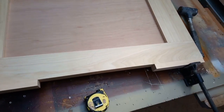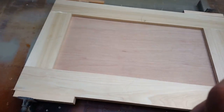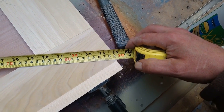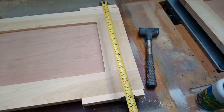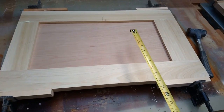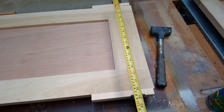Number two is glued together. It's important you get your clamps straight across like that and measure corner to corner. To do that you need to leave your packers short so you can get your tape on that corner and also see that corner there. If you find you're out of square, you can put these clamps at an angle like that — as you tighten it up it'll pull it to the shape you want, pull it square. That's why it's important to put them on straight in the first place; if you put them on at an angle initially it'll pull it out of square.